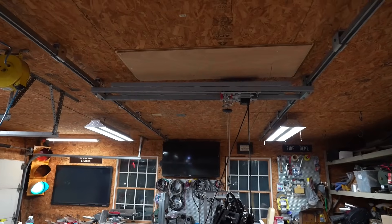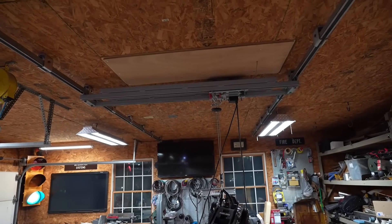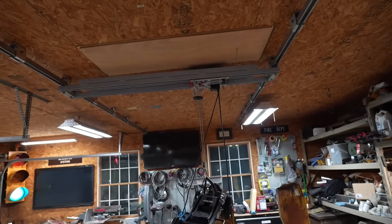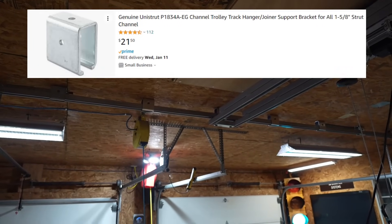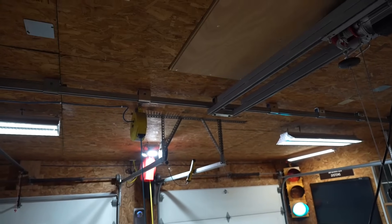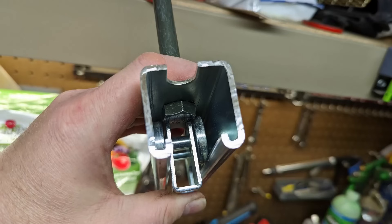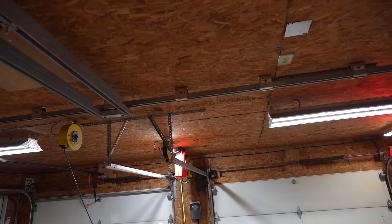A few things to consider: the track across the ceiling needs to be in parallel and measured precisely — I used a string line and it really wasn't that big of a deal. But if you get any of them a little crooked or off, the carrier is going to bind up. The carrier is also hanging from rollers, and I'll put a link to all the parts and pieces down below. Worth mentioning: these hangers are extremely expensive. I was actually able to find some on eBay that were used for not a lot of money — I bought basically a bucket of them. To buy them new, they're kind of pricey, but I'll put a link below so you know what to look for. You have to use the hangers because if you put any kind of bolt underneath it all, it gets in the way of the wheels. The Unistrut — whatever brand you're buying — you can get from any big box store; I bought mine from Menards.